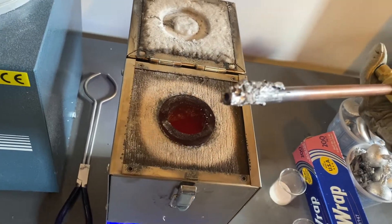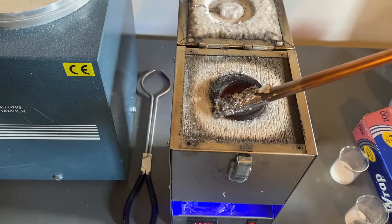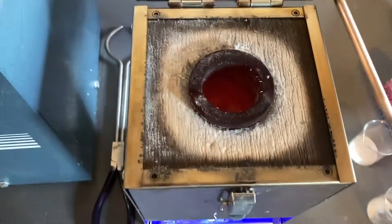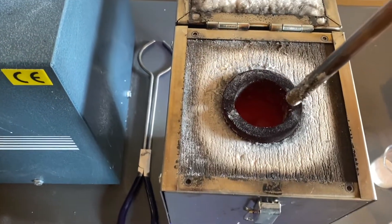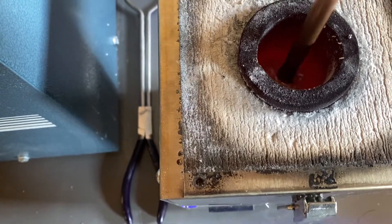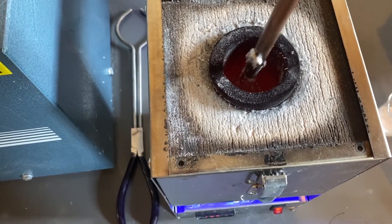The opening is still clean — there's definitely some aluminum stuck on the end, but the gas flow path is still open, which is good. I'm going to increase the pressure a bit. I've turned it up to about 20 PSI. At 20 PSI, this is definitely more of a violent bubble, almost reaching the top, so I think a good number is somewhere between 10 and 20.